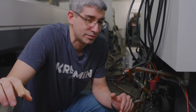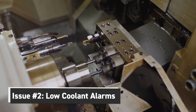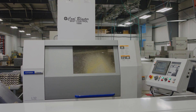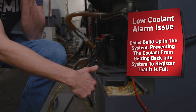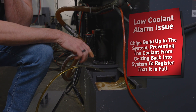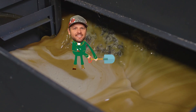Another issue to be aware of that's really across the board with our Swiss lathes is coolant flow and low coolant alarms. We take a lot of pride in running our machines lights out, and the number one issue we come into if there was a failure with the lights out operation is a low coolant alarm. Ironically, it doesn't really have anything to do with the amount of coolant in the machine — there's plenty of coolant. It's got to do with the flow of that coolant and the amount of chips that build up. Chips build up into the system so much that it doesn't allow the coolant to get back in and through the system to register that it's full, so it alarms the machine out. We spend a lot of time cleaning these out — sometimes you've got to get Trevor in there with his toy shovel to get really down and dirty to clean these out so they keep running.